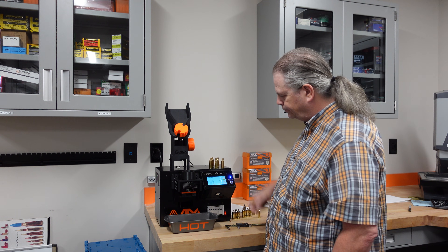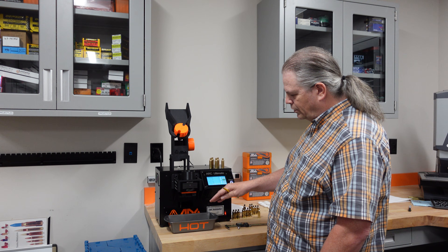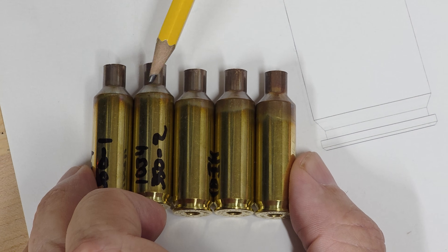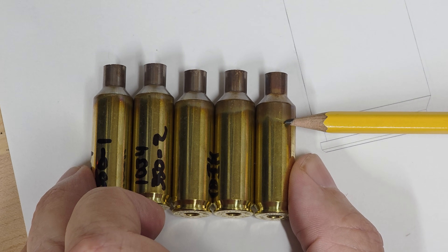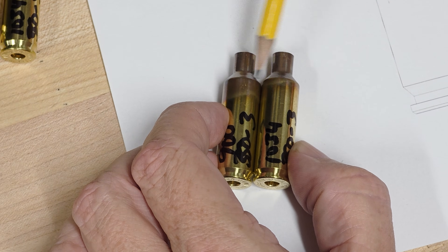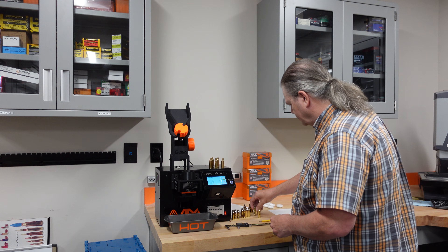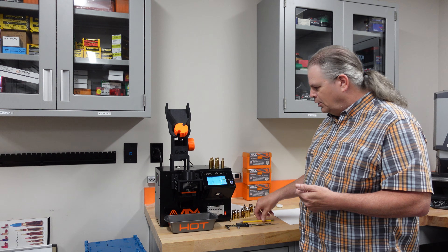I'll go ahead and anneal with the new settings — drop the shell in, it does its anneal, and I look at the effect of the color line as I go along. I have a handful of shells showing the effect of sensor position, how it moves the heat further down the shell the lower the sensor you pick. I also went all the way to a height of 900 from 1034 to demonstrate the effect of height change. There's another sample showing only temperature change, illustrating how the color line moves down the shell. This demonstrates the overall functionality and how to set up programs.